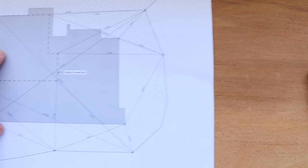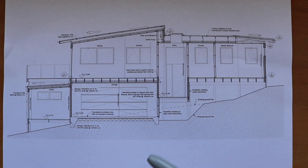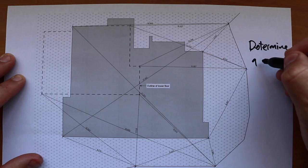There's not a single straight boundary to parallel the house off. Not only that, but the house is also on a slope with four different floor levels. So the first thing I did was determine a set out line. By the way, this is not the only way to do this — there's probably builders out there who have got a better way, but this is how I worked through the problem and what worked for me.